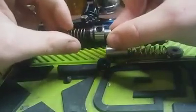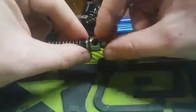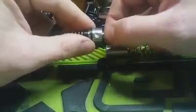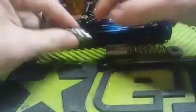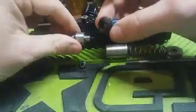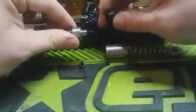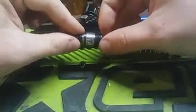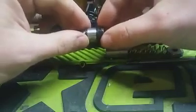You have a little bit of spring pressure as well as the air pressure pushing on this cup seal to keep the valve closed. There is an opening on one side, and there is a divot on the other side. There is a set screw right here which would go up through the body and hit this divot to keep your valve in place. In front of that, to also keep the valve in place, you have a valve lock nut - just a nice hollow nut that goes down here, threads into the body. That sits up against the valve and holds it in place, as well as the valve lock screw. The valve lock screw keeps the valve from rotating, whereas the lock nut keeps the valve from wandering around.